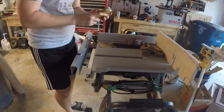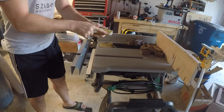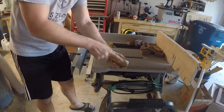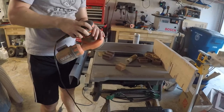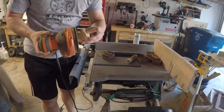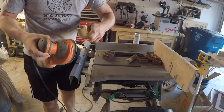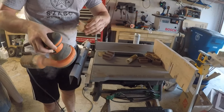Here's where I got a chance to try out those sanding sticks, and unfortunately they didn't work out quite how I hoped. They were just a little bit too oversized and I wasn't able to hit all the surfaces right. After giving it an honest effort, I pulled out the orbital sander and started going through the grits. I set it to about a medium speed starting at 100 grit, began shaping the edges while getting rid of the unevenness and marks from the drill, then moved up to 180 grit and then 240 grit.